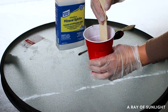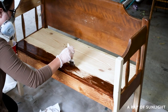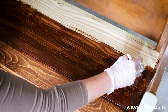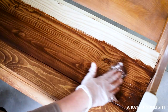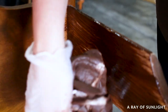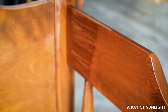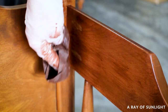This was my first time using heirloom traditions stain and it worked pretty well. It's an all-in-one stain with a built-in top coat, and it is also oil-based, flammable, and stinky — hence why I moved outside to use it. I also tested it over the existing walnut finish and it matched perfectly and made the old finish look new again. I let the stain dry overnight and made sure to lay my stained rags and brush outside to dry completely before throwing them away to prevent any fires.